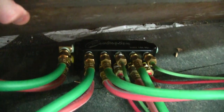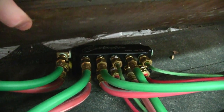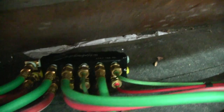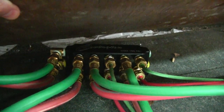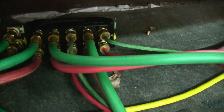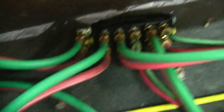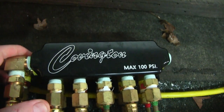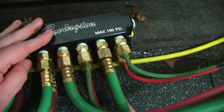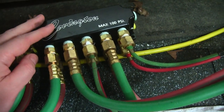Here's my manifold. It is feeding all of my torches, my lathe, and my mini torches. It just has two lines that come in and then the lines that go out. It can hold a couple more torches but it's really at capacity right now — I have five torches or mini torches or the lathe all hooked up to it. This is by Covington Engineering, and they make really good stuff. Highly recommended. You can get it with all the fittings in it depending on how much you need, and they all come pre-taped and assembled. You want to check for leaks after you're done hooking everything up.